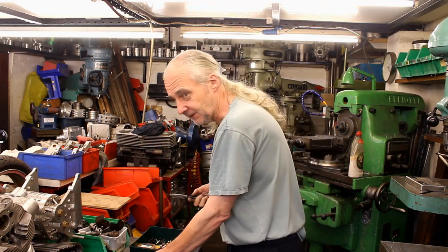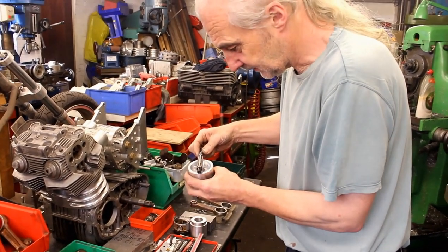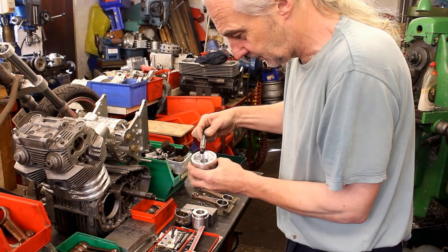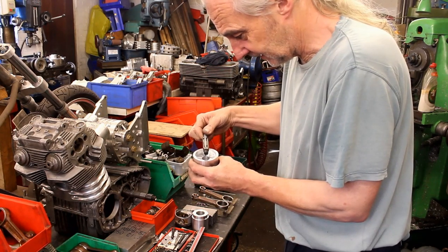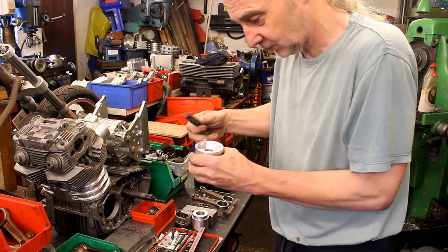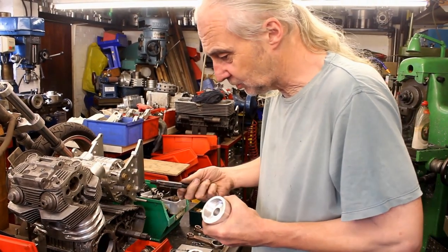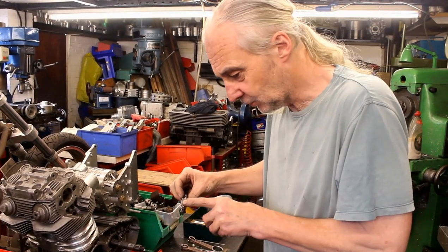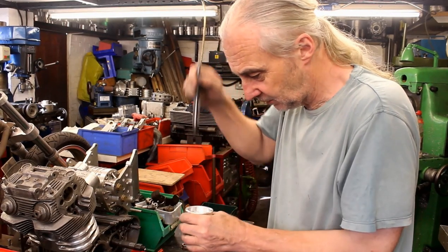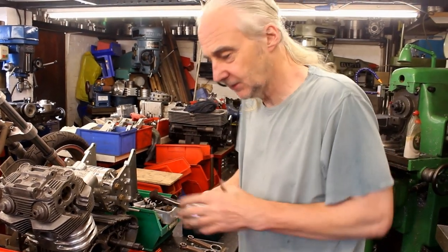The other thing with a piston, if you go through that sort of length and it enters the other side and kicks a little bit, it can send a shockwave through to your other side. So you need a very small stone. I think they're encrusted diamond honers. It's smaller, but it's adjustable, so you just keep going. It's an adjustable diamond-coated honer, and you're only talking microns at a time, so your gudgeon pin is spot on, just that push fit.